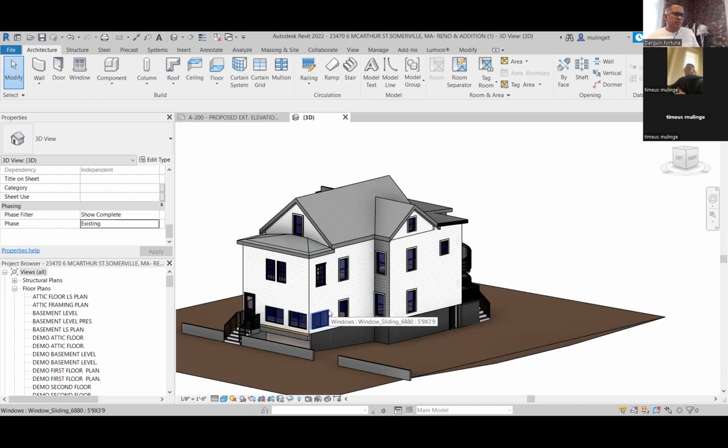Now, coming into this building, I wanted to make those openings bigger and have a bigger connection in those public spaces, which included removing those beams and the columns to make it more open concept. So what you're saying is this whole diaphragm element is your initial home. Then they did this addition, and this still has some load bearing elements within it, but you wanted to remove some of that and create a connection between that front addition and the interior of the house. Is that right? Yes. All right, I understand it.